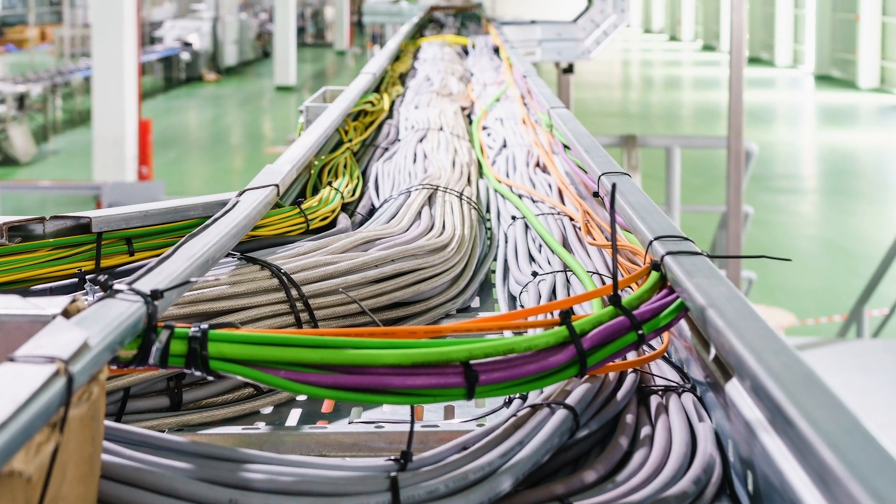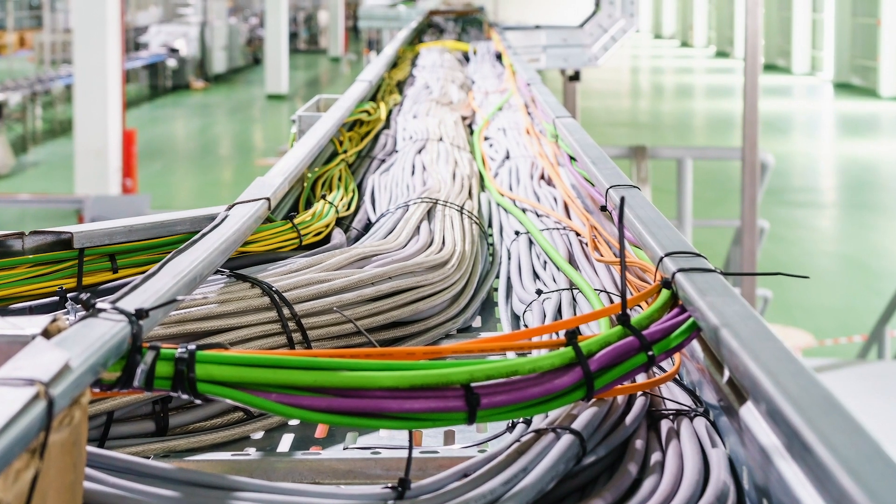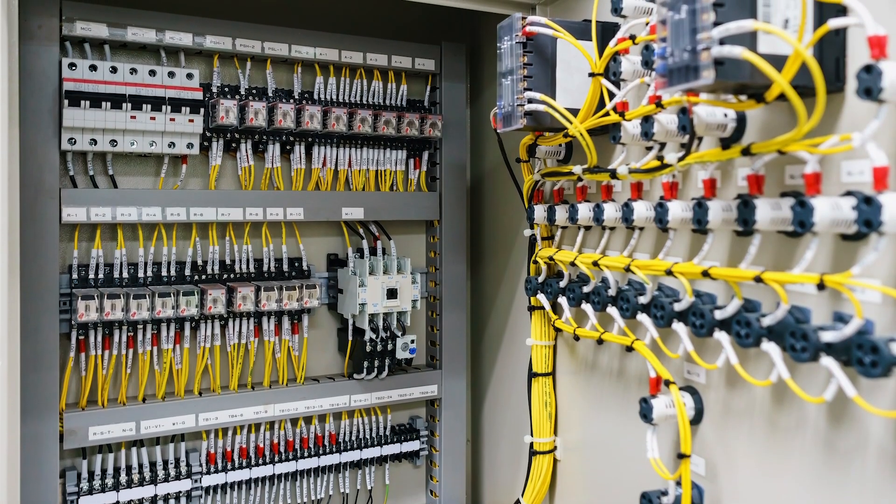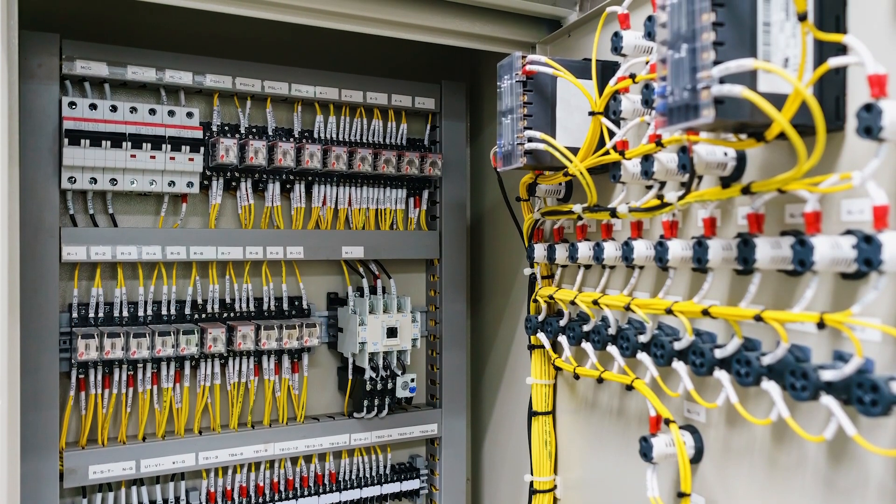Electrical noise, or electromagnetic interference, is a rogue signal that can dramatically affect normal operation of industrial equipment. There are many ways to reduce EMI that require nothing more than smart design choices, like routing power cables and signal cables in a separate cable tray or conduit, or making sure that cables cross each other at a 90-degree angle.